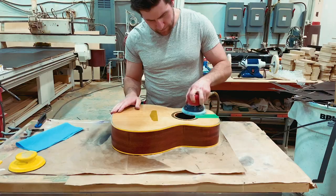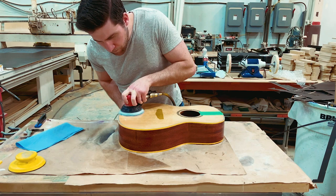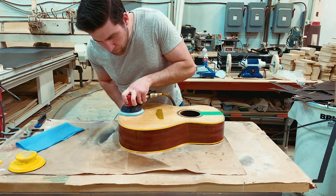This is real-time sanding speed. Nobody likes to watch sanding, and a lot of people don't like to do sanding, so we're going to speed this up. I'm sanding this entire guitar at 800 grit. This is about a week later after having done the painting — I've given that sanding sealer plenty of time to dry. A week is unnecessary. Here we are at 300% speed now.